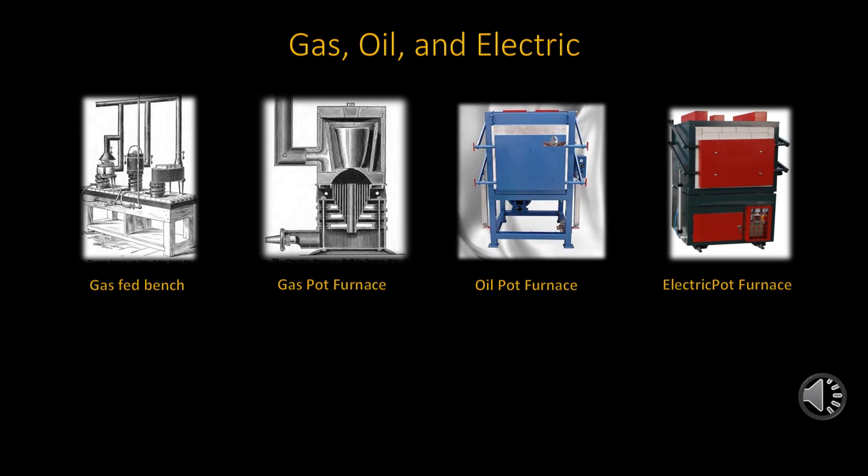These too had their problems with soot. These days, propane and natural gas fired furnaces are used where electricity is not available, or the cost of electricity is too expensive to operate electric furnaces. These newer designs are much cleaner, more efficient, and have excellent temperature control — set the desired temperature and away you go. Some are top loaded and some are side loaded. Temperatures range from 1000 degrees centigrade to 1800 degrees centigrade. Fusion furnaces are considered closed system furnaces — the crucible is completely engulfed in the combusting gases, which exit into the chimney. Unlike the muffle furnace, there is no access to clean, cool outside air.